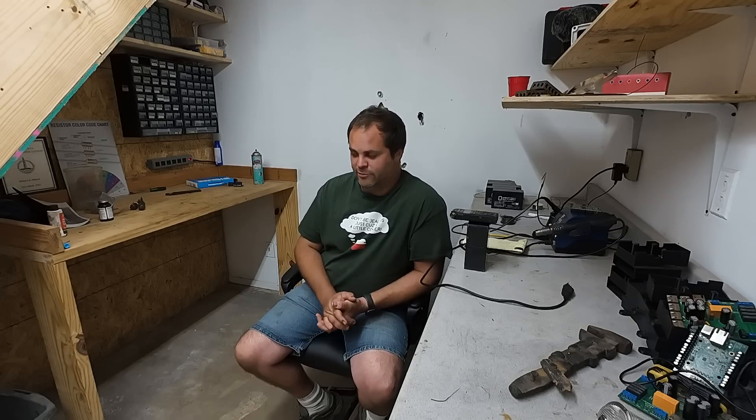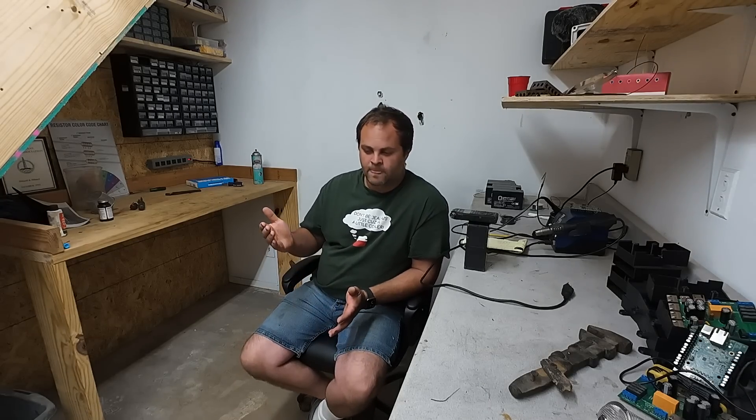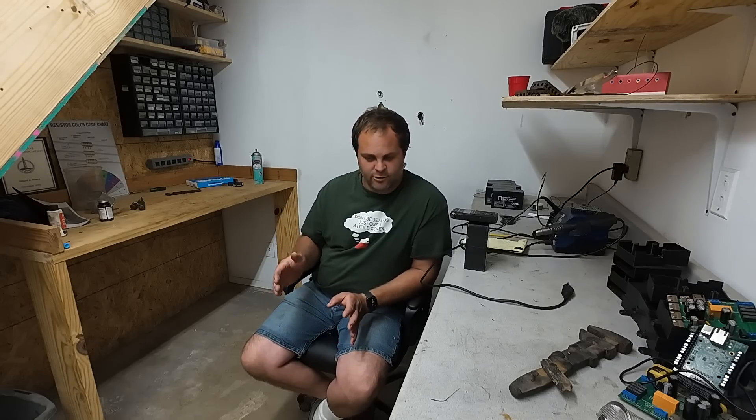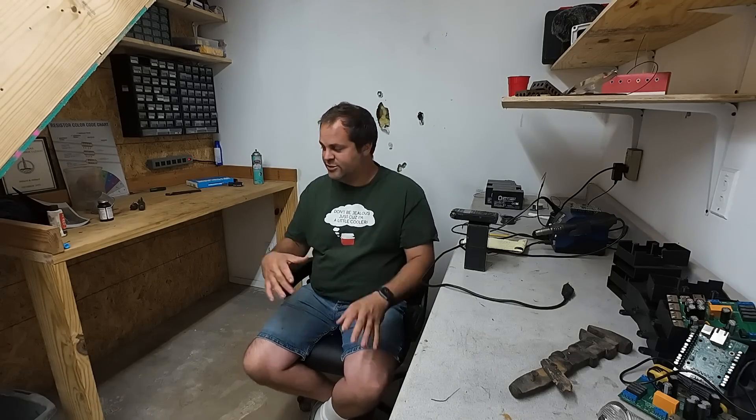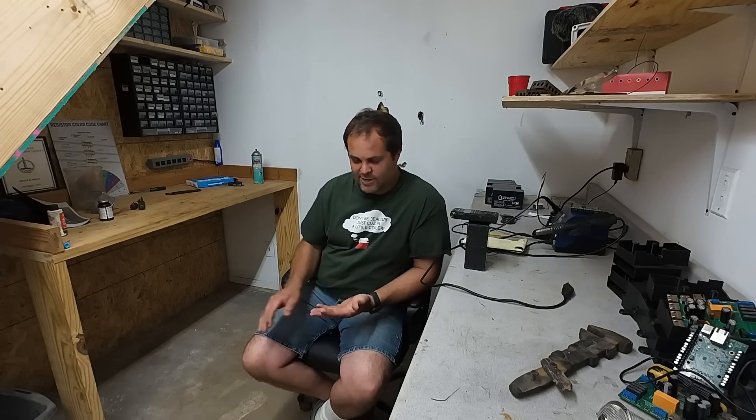When I wake up in the morning, if it's a false alarm — and that happens a couple of times a year — that's a whole lot better than driving up on a big mess. I also wanted the system to be relatively compact and simple to use, something I could hand someone and say, hey, plug this in. The last and probably one of the most important aspects: I wanted it to run without electricity. Power goes off all the time. If the power goes off, your pump won't run. If your pump is hooked up to a different set of transformers, you can have the same issue — run your tank over. I want it to notify me immediately when electricity goes off: a text message that says, hey, such-and-such lease, power off.